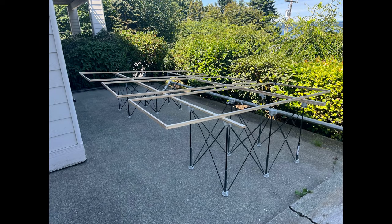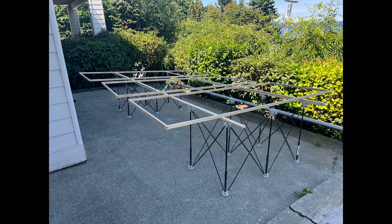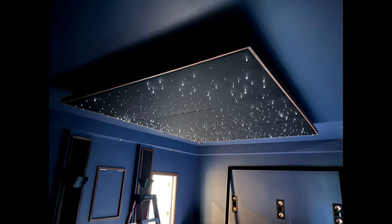The last bit of info on this video is the star ceiling kit. We source ours from Epic Sky — I've got three or four different videos on our YouTube channel about star ceilings. What's different on this one is that the panels are extremely large. Since they're built on site, we were able to do them at 42 inches by 8 feet, times three, which gives a massive star ceiling feature with only two seams down the middle. It's a two-kit star ceiling — if my count is right it's over 500 fiber optic stars — and the ceiling itself is close to 10 feet by 8 feet.